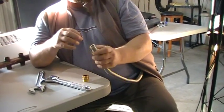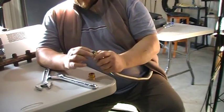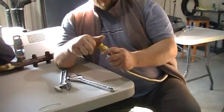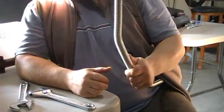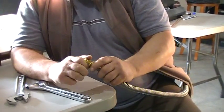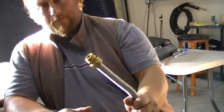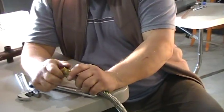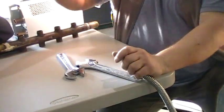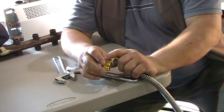This is five-eighths — same fitting as the collector. We use a graphite washer. The quick connect also comes with adapters that you can screw in. This is five-eighths compression. The quick connects — most of them are compression to NPT. Over there there's a bunch that are NPT. I just happened to grab one that was two compression. But what you'll get is one side compression, one side NPT.